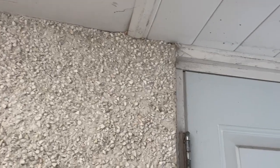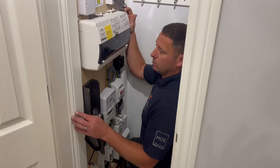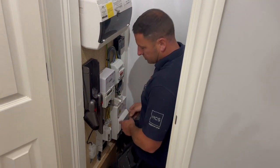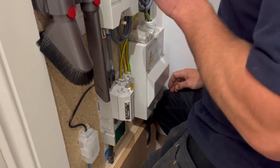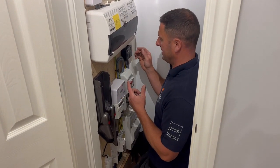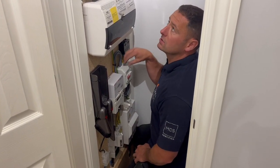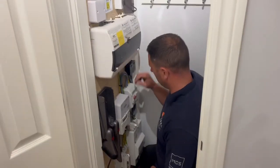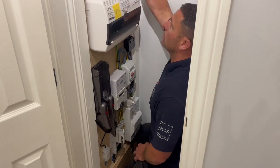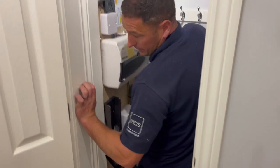We've showed you the DC route in the garage. It's a tight squeeze in here but we've got quite a lot of work to do. We've had to introduce a switch fuse — that comes after the meter and supplies the distribution board or consumer unit we've fitted in the garage. We've also swapped this out for a surge protection device unit, which covers not just the work we've done but the entire house. All labeled up.